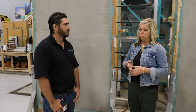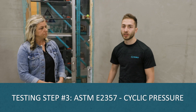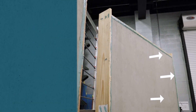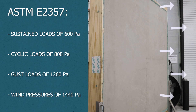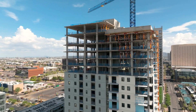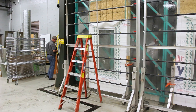Now for these panels themselves, we also wanted to do ASTM E2357. That's the next stage for the assemblies we have here. ASTM E2357 is aimed to fatigue the elements of the wall, like the joints and any seams that you might have. You're putting in wind gusts, doing different cycling — 1,000 cycles at 1,000 pascals, and then wind gusts at 1,200 pascals.